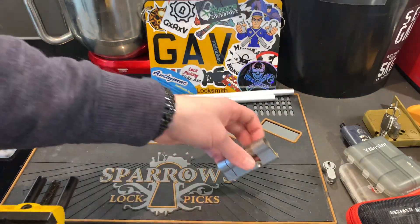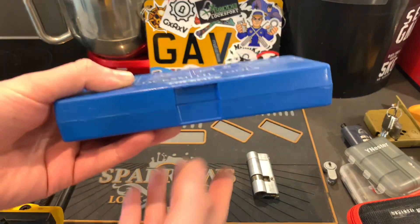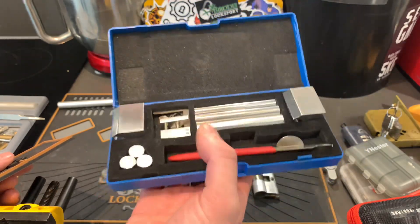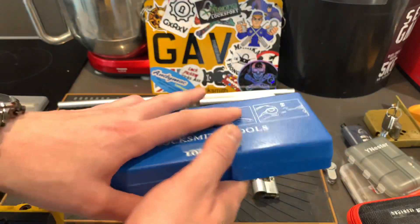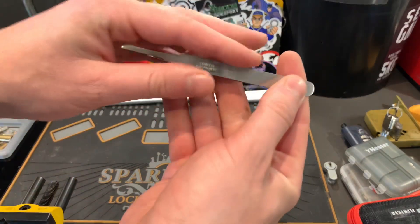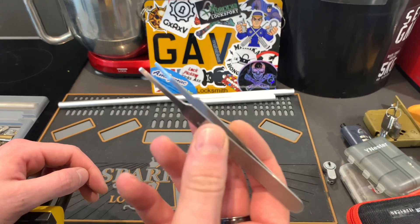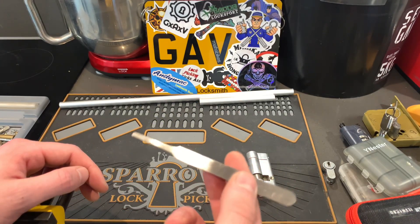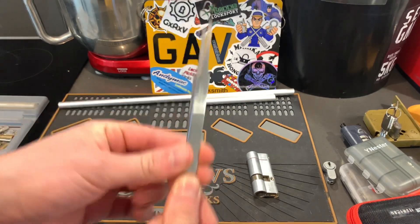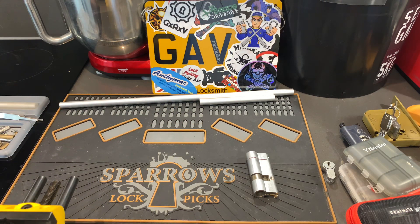On the subject of that, I'd recommend finding this kit here — almost everyone's got it and loads of people know what it is. It has followers in it, front-loaded tools and things to hold your core. It also comes with a pair of tweezers that are stainless steel non-magnetic, which is very important. You'll drive yourself insane trying to use magnetic tweezers because they won't let go of things. That blue set is my number one go-to for disassembling locks, and it's kind of cheap as well.